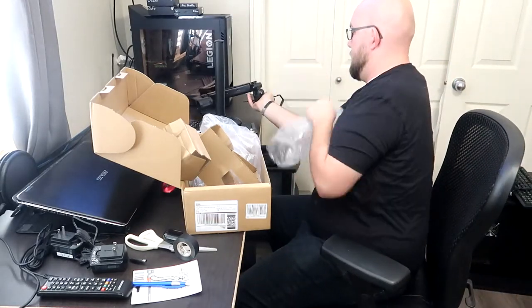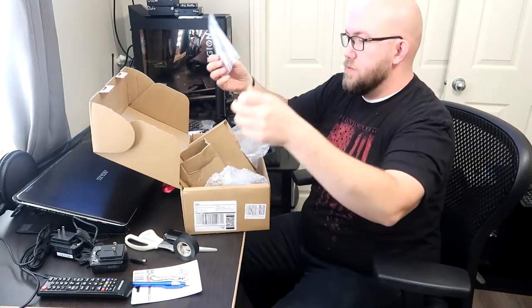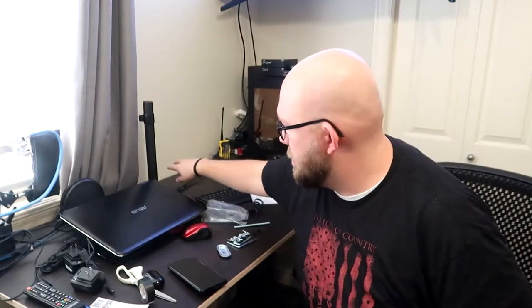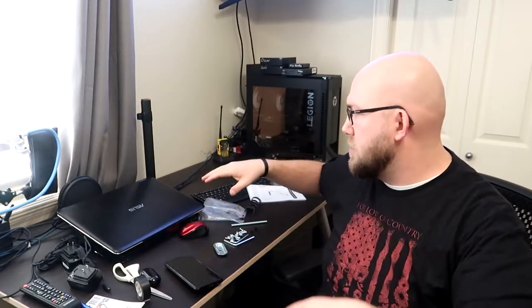All right. And a bag full of screws. There's instructions, but I have a feeling I might be able to figure this one out. Well then, as I was starting to screw down the clamp on this guy, I noticed an immediate issue. This countertop here is 3/4 inch, and that is just a little bit too small for this guy. It's not gonna get a good bite, so I'm gonna go grab another piece of this, cut it down to be maybe a little block that I can then screw onto the bottom here to use as a plate that'll disperse that pressure, but also make that clamp able to grab on better.